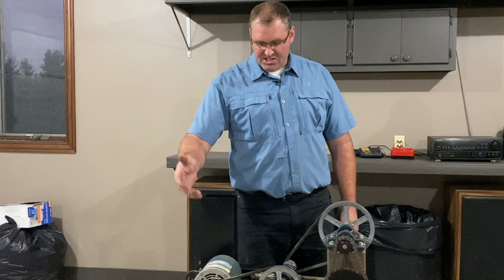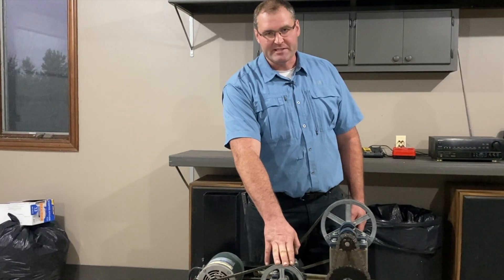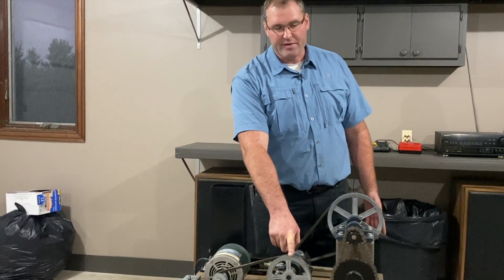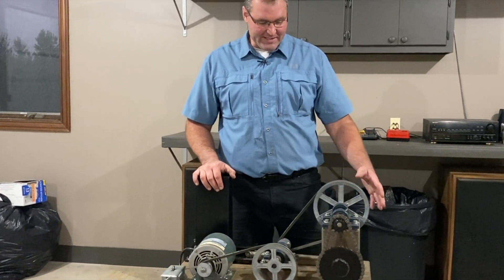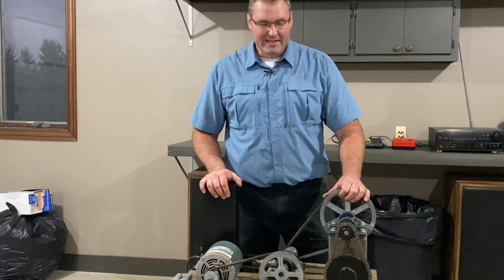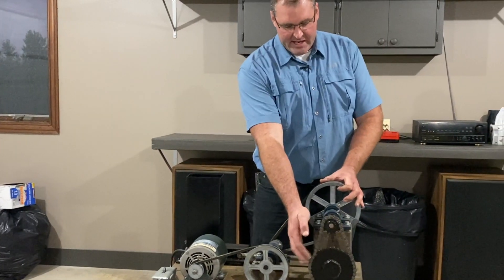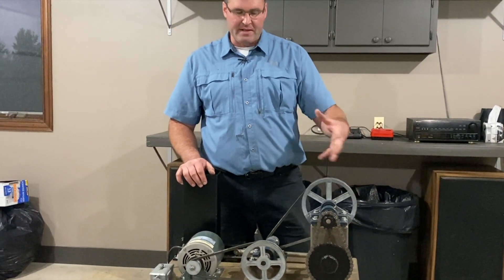Using pulley theory, a small pulley driving a big pulley slows things down by whatever the ratio is. If you've got three times more circumference on the big one, you reduce your speed by one third, and so on. Then I got to this point and had a hard time — with so much pressure crushing the can, I had trouble keeping the belt from slipping, so I added a chain. If you're wondering why there are two belts and a chain, that's why — because the most force was on this final stage and we were having problems keeping that all strong.